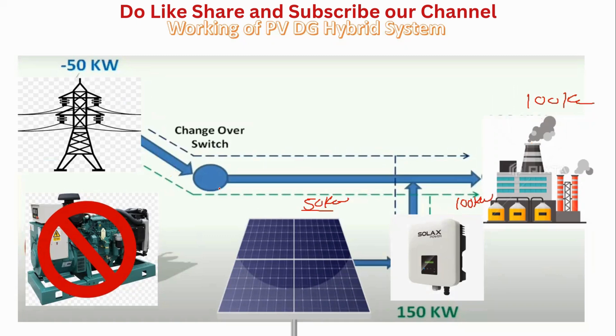The requisite power for the load is absorbed by the consumer and the excess power is absorbed by the grid. A bi-directional meter is connected here, recording both the power sent to the grid and the power imported from the grid, and the electricity billing is calculated accordingly. The grid is an infinite grid, so it absorbs all excess power, and another consumer will utilize this 50 kilowatt capacity.